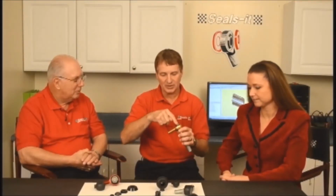And this brings us perfectly, Carrie, into our next piece, because the ones that are a little inconsistent, Seals It has taken the rod end to the next level. The rod end ball is basically mathematically put to maximum 22 degrees of angle and so on and so forth. It doesn't move or flex. Seals It has come out with what they call the elastomeric rod end. What this rod end is, there's a receiver groove, like a snap-ring groove, machined into the boss. Then the rubber and a bushing that has spirals on it to mold the rubber into it.